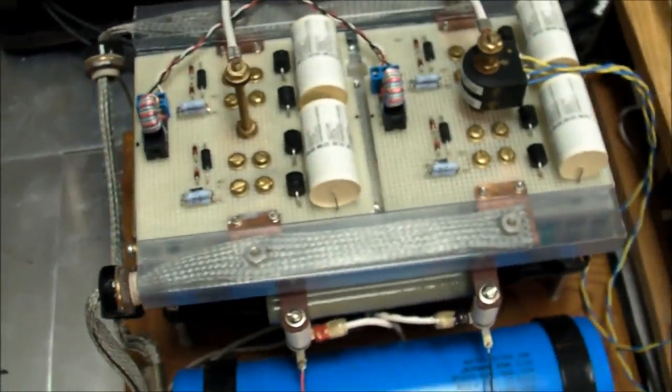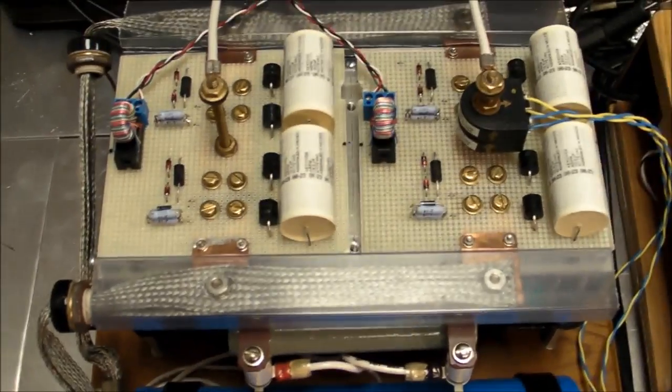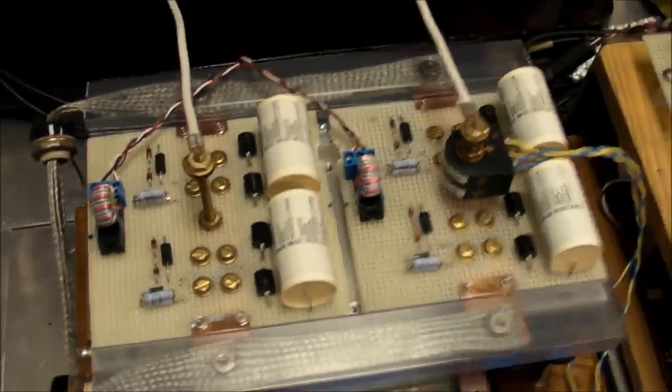This ground connection should have been right here and it wasn't there. Here's the ground terminal going way down to the ground plate — big thick ground cable all over the place. I was running my double resonant circuit at the time, and as soon as this happened it stopped working, so I must have blown some of my IGBTs.